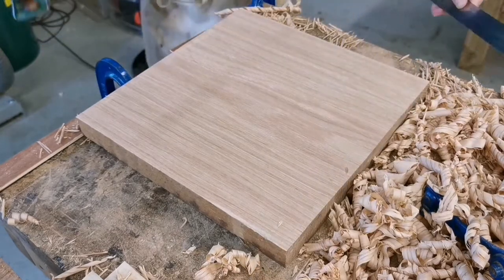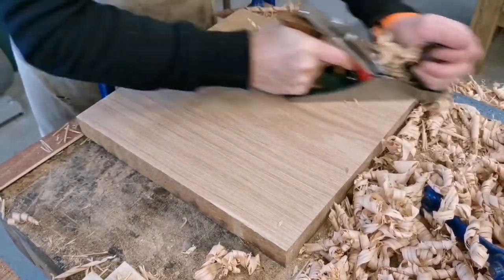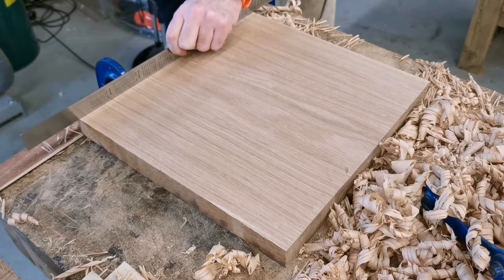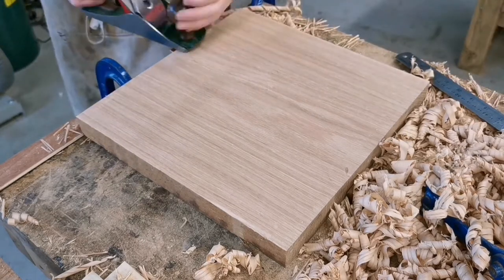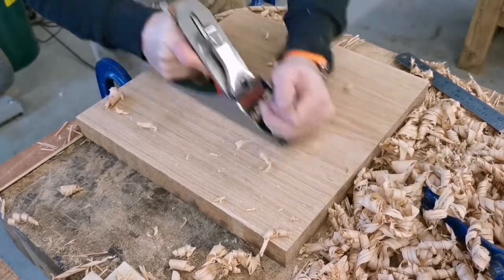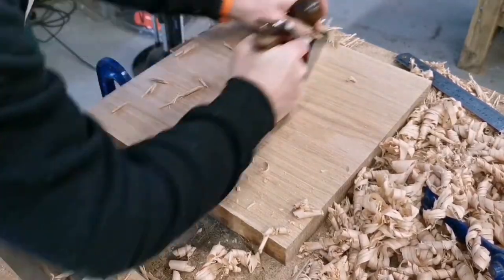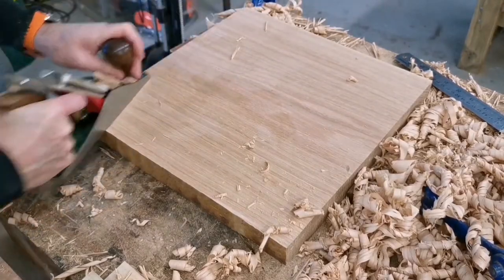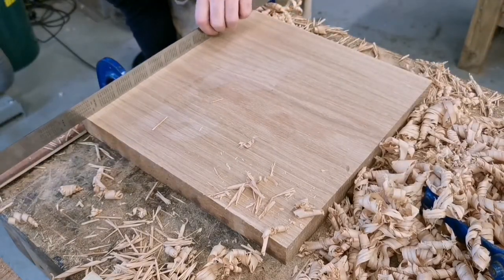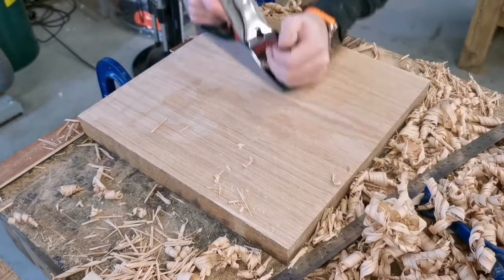Just double-checking where I've got to remove some from. Here again, another point where it's pivoting — which is about where the cramps were holding, so bad to happen, it's inevitable. Straightening off down an edge is a really good thing to do, working your way across the plank. Planing slightly canted — we used to call it canted — so at an angle so that it slices the cut. Then double-checking again how it's doing, and going to the middle to see what the middle's doing. The middle needs some taking off as well.